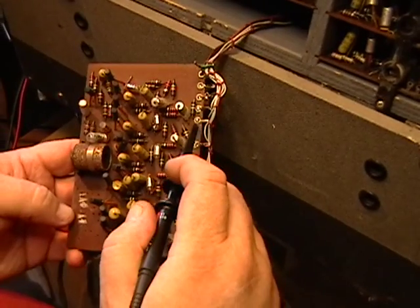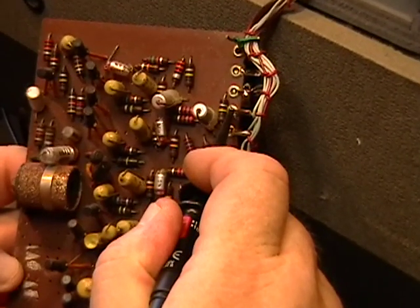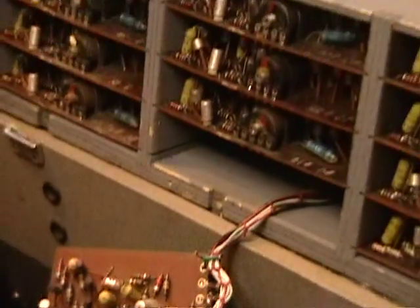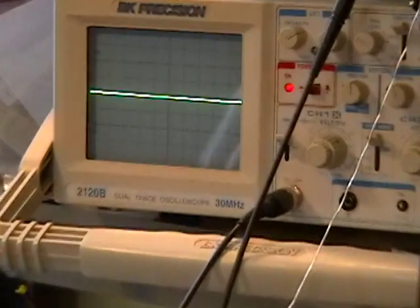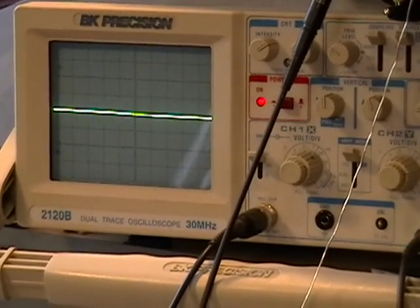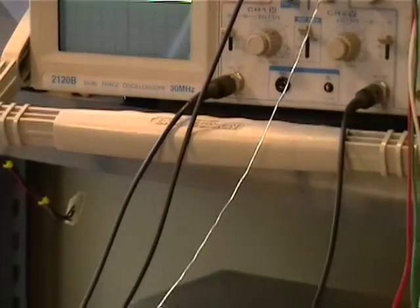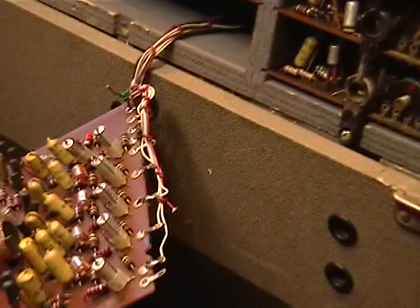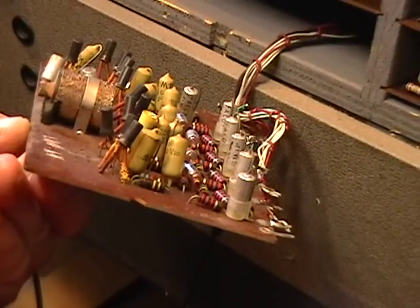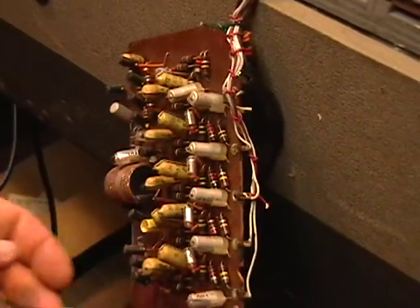Alrighty, we're here on the A sharp chord. There was some confusion as to what note we were on, but the A sharp is showing 1 divider, 2 dividers, 3 dividers, 4 dividers, 5 dividers, and divider number 6 is not operating, which would be the lowest footage. Yes, the low note. So we're going to look at the schematic for this. There is the possibility that it is a transistor, and if so, we're going to be changing this. If not, this could also be a capacitor issue.